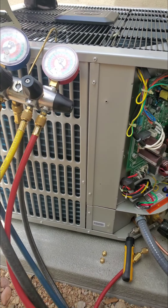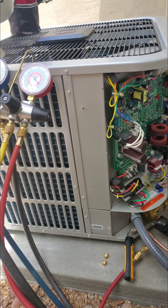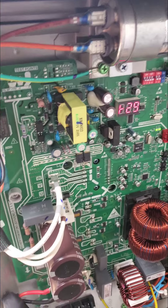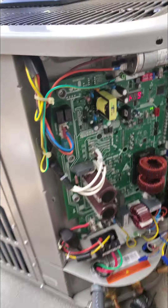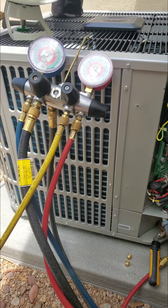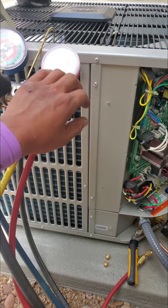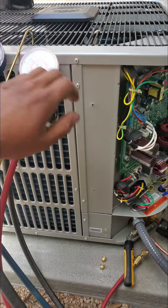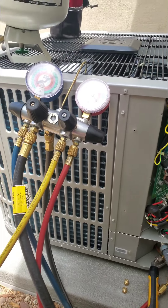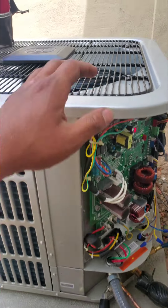In this specific scenario, that's six degrees of sub-cooling. According to the manufacturer, this number over here says 29 right now — it has to say 72 for us to be able to charge it. I'm not sure if that means hertz, but that's just what the manufacturer tells you. Every manufacturer is different; some require 100, but this one requires 72.